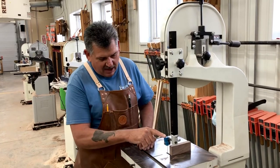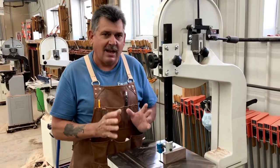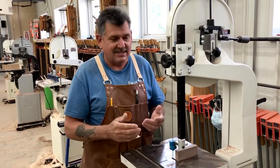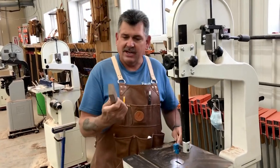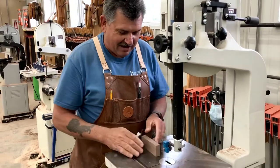I'm going to show you real quick a small blade guide, which is for quarter-inch or smaller blades. This will allow you to do some tight turns that you wouldn't normally be able to do if you had side guides. So I'm just going to take this small block and we'll do a quick backboard.